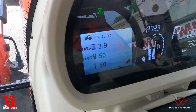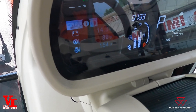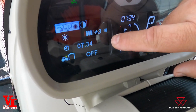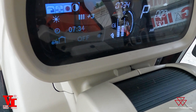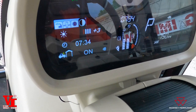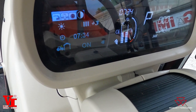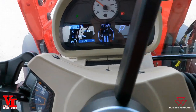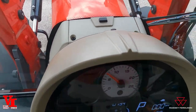That's pretty much the home screen — here you can preset your takeoff speeds. Your engine speed, you're in joystick mode, we have auto neutral, our three-point percentage, and preset gear takeoff C1 and C2. The next one has some information on your voltage, your temperature of your engine, your transmission temperature. This is the brightness of the display, the time, and the bottom one is the barn mode feature — you pull into the barn and the lights will stay on until you exit the tractor for a little bit, then shut off.